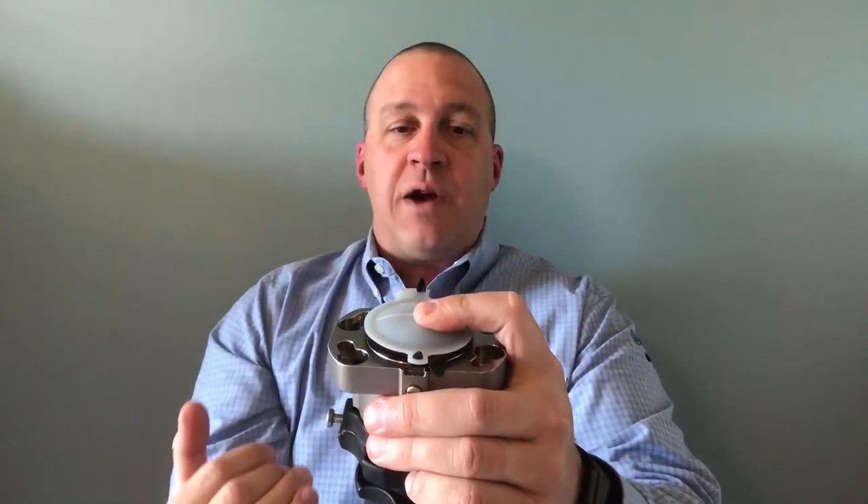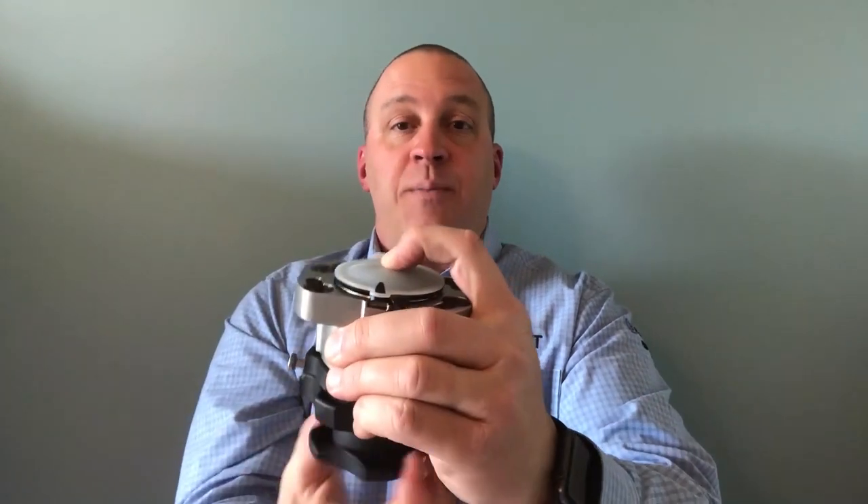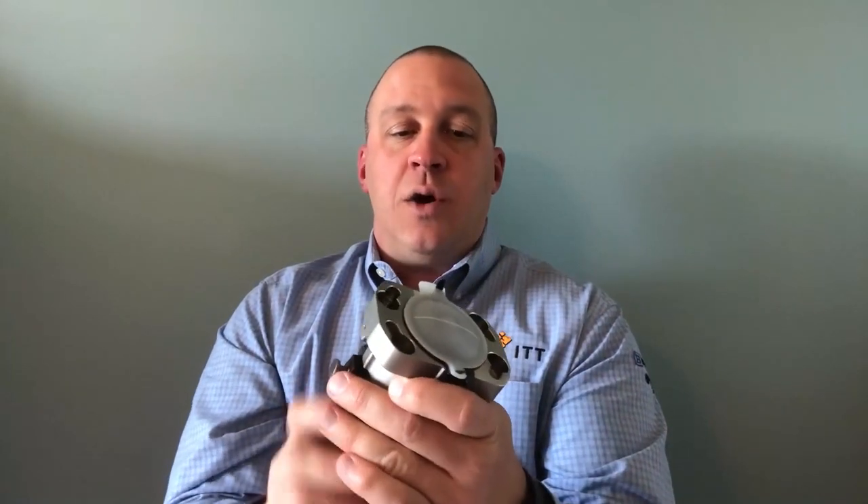Once that's married up, the valve is in the closed position. You want to bring it down and firm it up into a neutral position against the bonnet so that the tabs line up with those cut-outs. That ensures proper positioning of the diaphragm. If it's out of position, you won't be able to get everything back together — it's a foolproof system. As long as you have those diaphragm tabs lined up, you're good to go. Bring it back to a neutral position.